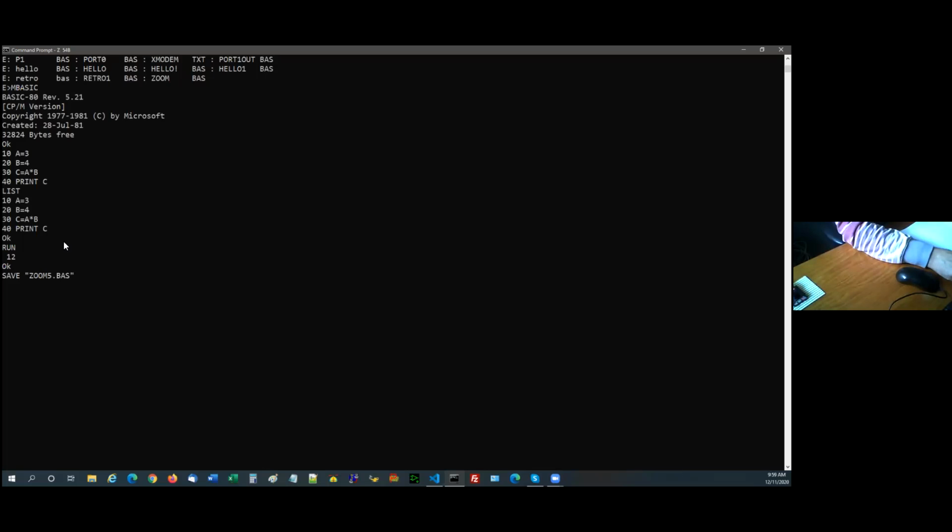Right. But when compared to the P1 where we had to go to external static RAM, having it in hub is really ideal. And I haven't tweaked this code to use all the decoding stuff that you wrote for running an interpreter. It's still running my old method of getting a set of vectors. So there's 3 vectors that it gets. So every instruction that it emulates is divided down into 3 possible subroutines.